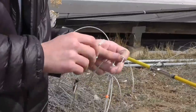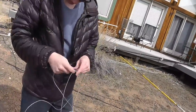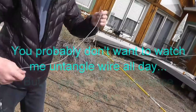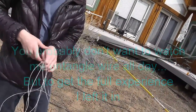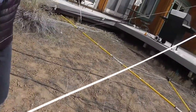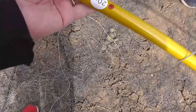This turns out to be the thing taking the most time — unraveling and straightening out these elements. I think we need to change how these elements are shipped. They should be in a single coil, preferably on some sort of form. This is complicated by the fact that those springs have little hooks on them and they're already assembled. We've got this undone now. We'll go ahead and put 20 right here with that second spring — notice it's easiest to put it in from the side.